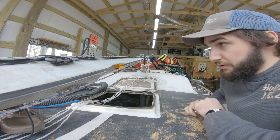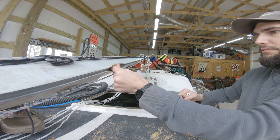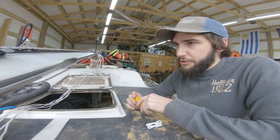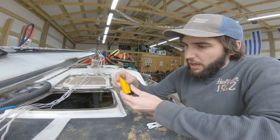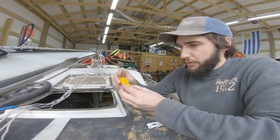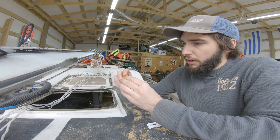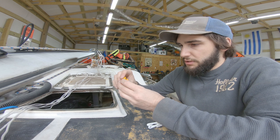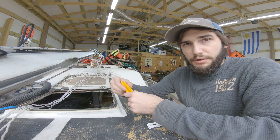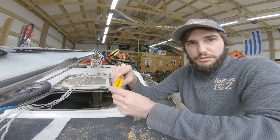The transition is almost there — getting close. We're having some issues with the 3D printer not keeping the material warm enough while it's printing, so we're getting a little bit of separation. That doesn't necessarily affect the design at the moment, but for the final product that's obviously not acceptable. For modeling purposes we're just fine-tuning the 3D printer settings for this material and seeing what works and what doesn't. Hopefully by the time we get to something that actually works in the mast, we'll have the material settings figured out.